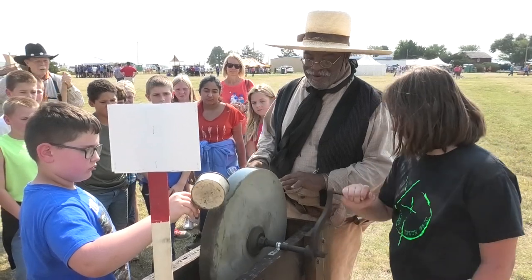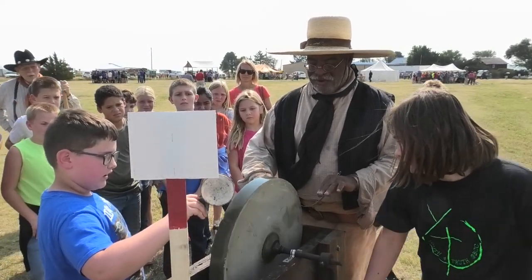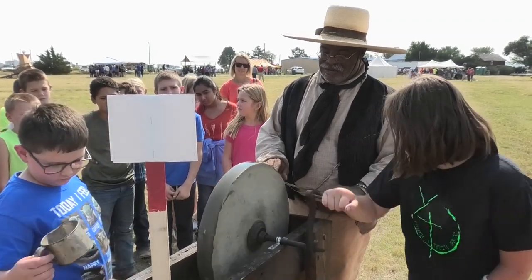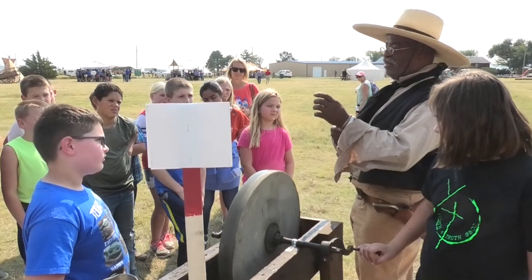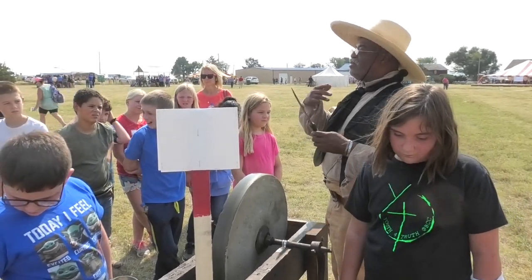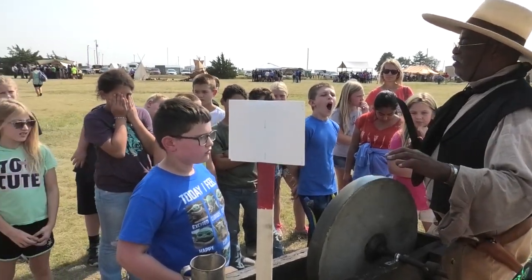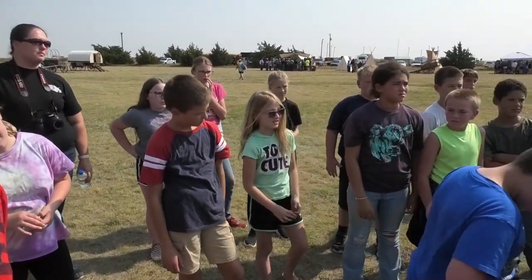I'm going to sharpen the knife, just like that. I'm going all the way around, then I'm going to do the other side — holding it against the edge. What I just did was grind. I was grinding the knife — the wheel against the knife blade. It grinds off bits of metal from the knife blade. Why do we use the water? The water helps to float those bits of metal off the surface of the wheel. If I don't do that, the bits of metal get down into the wheel and take away the smooth finish. The wheel needs to be smooth in order to work.